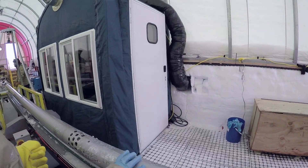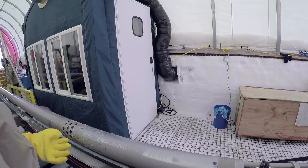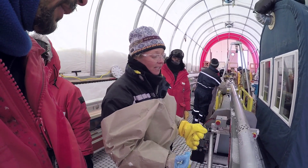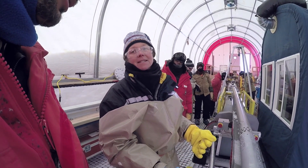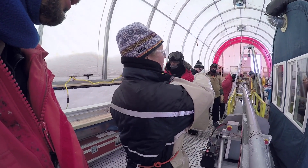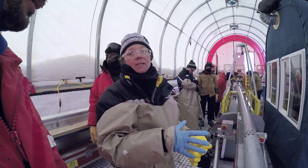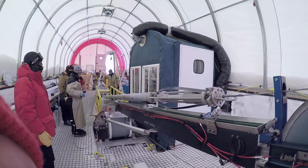This is the motor instrument section — essentially the brain of the drill. The idea is 100% recovery of the chips collected, but that doesn't always happen. What do you do with them? We actually put them through the centrifuge, which is the blue tent over there. We spin out all the fluid, capture that, and plumb it back down the borehole.